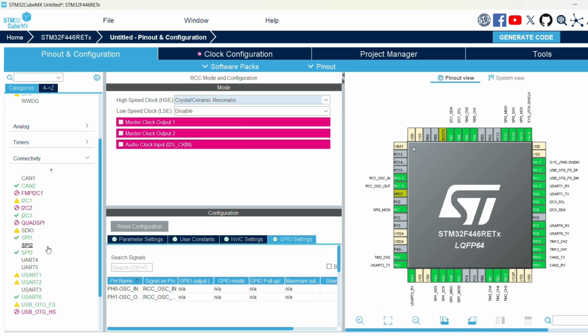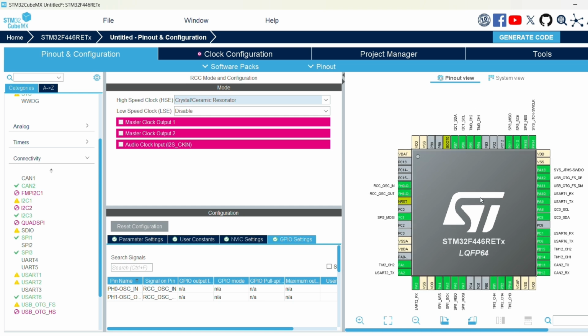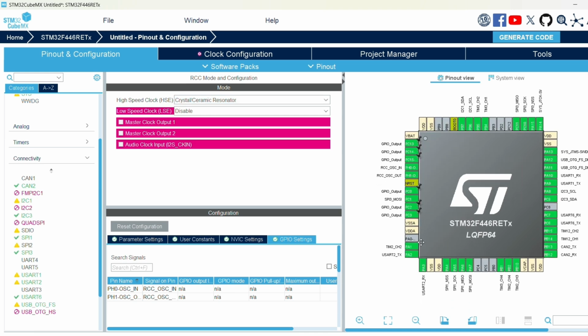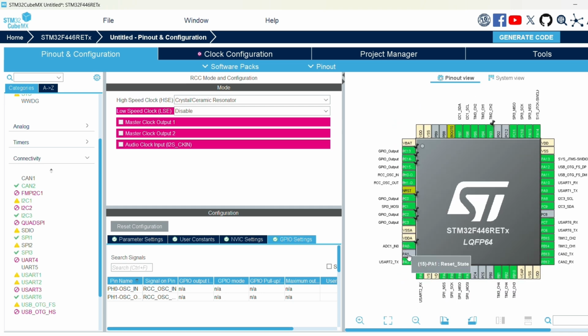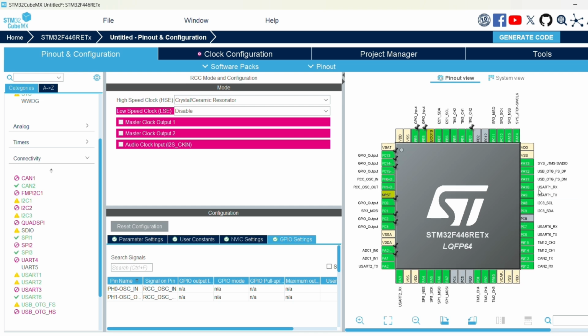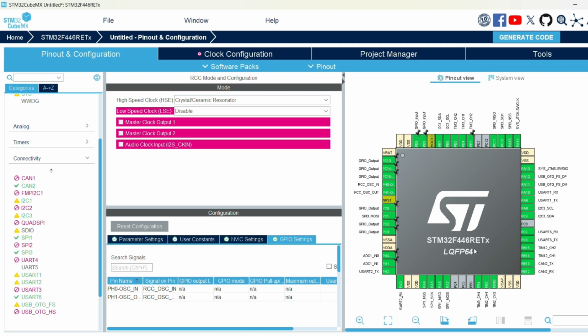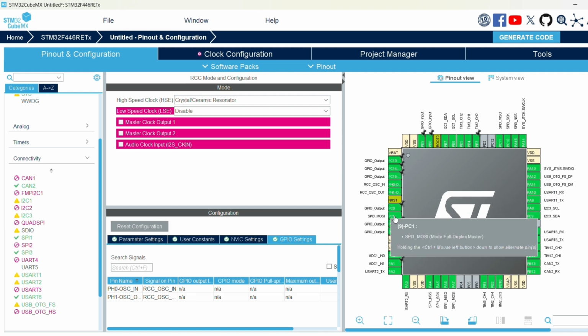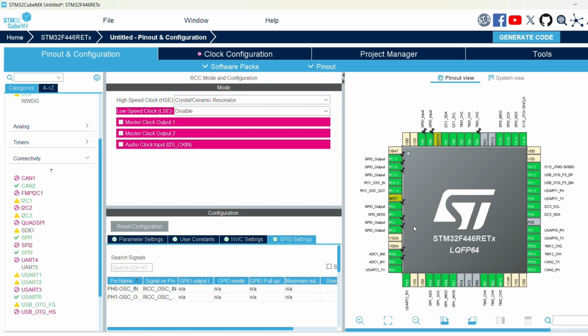So we've got every single communication interface pretty much. Now we can define some general purpose input-output pins as well. And there we go. So that's pretty much everything. We have 3 UARTs, 2 I2C interfaces, 2 SPI interfaces, 8 PWM outputs, and then I think it's 6 GPIO outputs, 2 GPIO inputs, and 2 analog to digital converters.